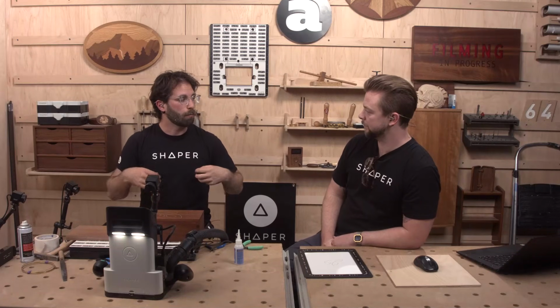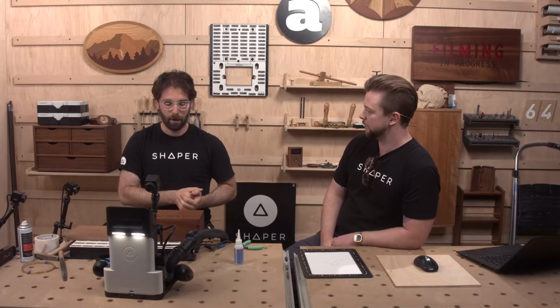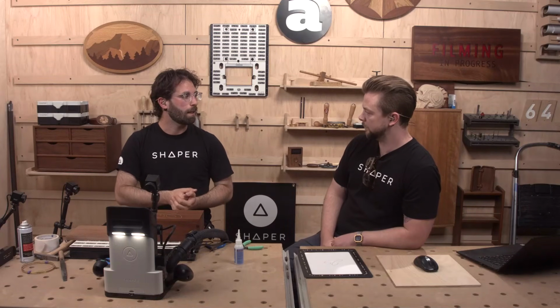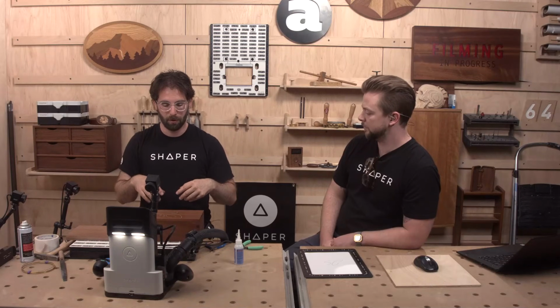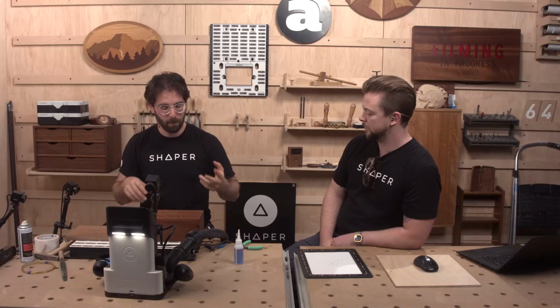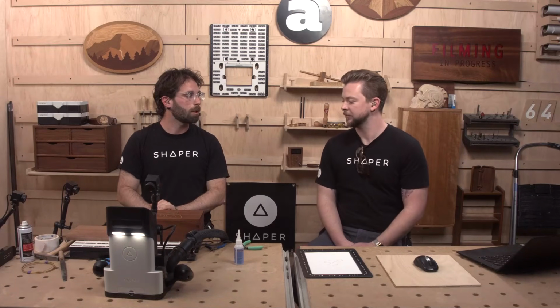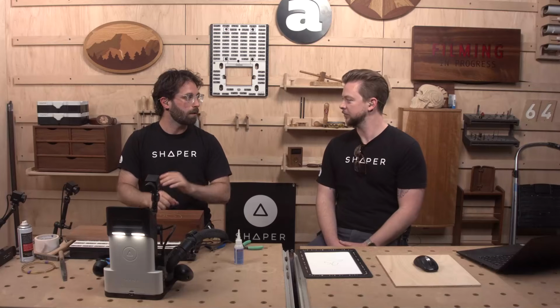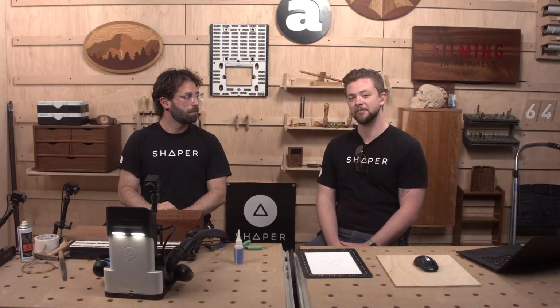So you know that classic brushed look where the metal looks like it has a grain going one direction? Like stainless steel railings kind of have that. You get that definitely by going one direction. If you want that look, definitely do that. But if you want it to be more of a polish, then I would say it doesn't really matter much which direction you go. And the random orbit's just so much easier to use than caring about how straight your sanding is. That's true. Cool.